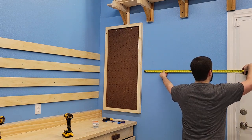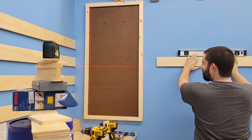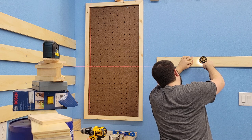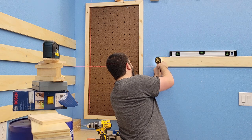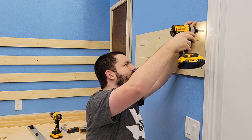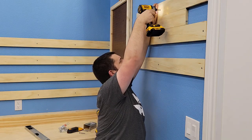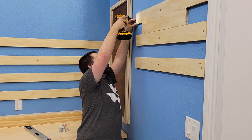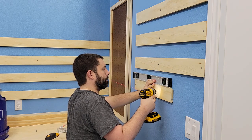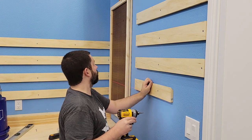Now to finish off this wall, I used a laser level to help match the height of the French cleats on the first wall before adding the rest. Now that you can kind of see this layout, let's talk about why I did this. French cleats are where I plan on hanging larger groups of tools that will need their own kind of storage system — things like a saw till, cordless power tool station, and a hand plane rack. These tool holders will stick out from the wall quite a bit, which is why this corner is kind of wasted space. On the other hand, this pegboard will be good storage for those random one or two things not big enough to warrant a whole French cleat system — things like hammers, screwdrivers, levels, tape measures, even tape.